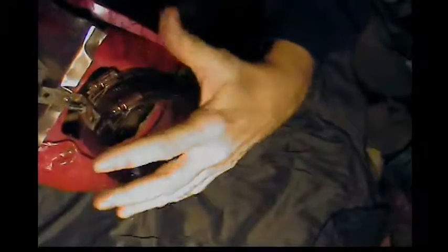The arm piece is a rubber tubing that you use for plumbing. It comes with a rubber piece in it, and this is the piece that bolts down onto whatever you're putting it onto, usually PVC piping or something. That's what we started with, and we used little L-shaped brackets and drilled holes through them into the metal bracket and bolted down on each corner, to hold the whole arm piece in there so you can stick your arm inside and be able to hold the chainsaw up.